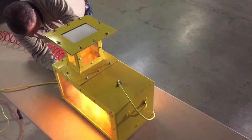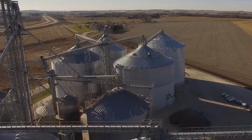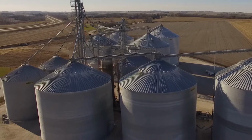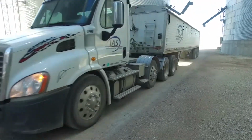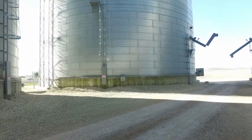So you get an ignition source. That may be a bearing that got hot, that may be a static spark that happened, and when the dust is put into suspension, that's where you get your explosion from. So typically that will happen in a piece of processing equipment. But as the explosion happens there, it rattles the dust loose in the confined area. So that's why housekeeping is important, to keep the dust level down, because if that dust gets shaken loose, then a secondary explosion happens. And the secondary explosion, that's typically when the real damage happens.